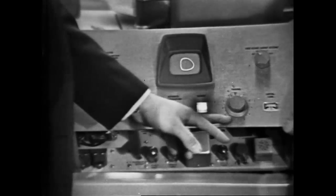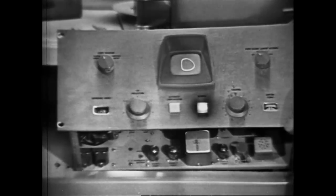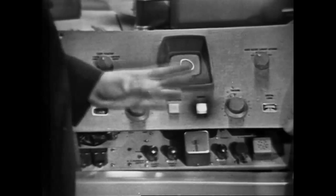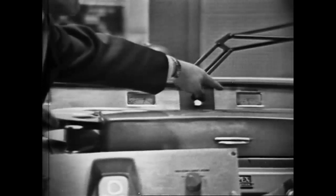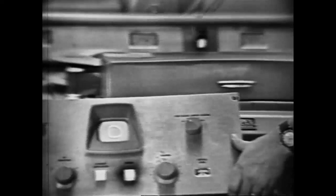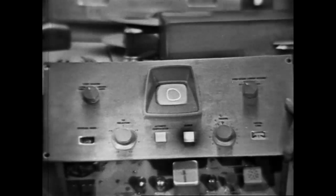On playback, we have a control mark tracking control. That's to permit the head to ride down the recorded track dead center, and not off to one side or the other. It's nothing but a phase shift network, which causes the tape to either ride forward slightly or back slightly in time in relation to the head rotation. This meter over here indicates the current on the various heads during record. You can see the meter change as I switch through the different heads. That calibration on the meter is not critical — it's really only an indication that you are getting record current to the heads.